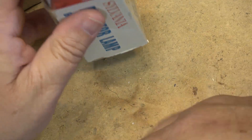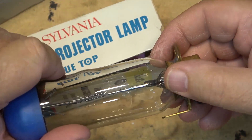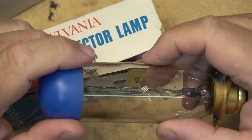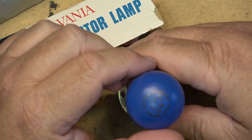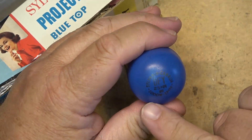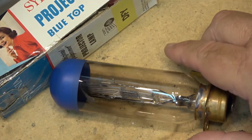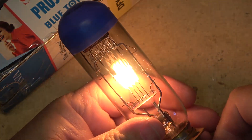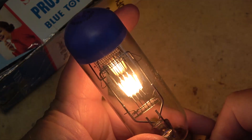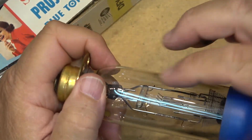Next we have this Sylvania blue-top lamp — and look at this one. It's been used — you can see the glass is already starting to deform from the heat. This one is called a DFY: 25-hour rated bulb, 120 volts, one thousand watts. Wow, one thousand watts at 120 volts — that's a big bulb. Let's just see if it lights up. The power supply is going to have trouble with this one. Four amps at 32 volts, and the heat coming off this thing — even at this reduced voltage it's hot. I can't hold my hand any closer than that to this lamp. As you can see, the heat from it caused the glass to deform.